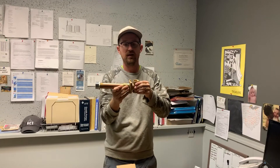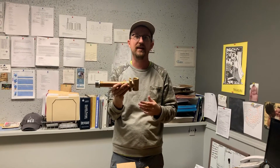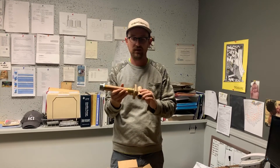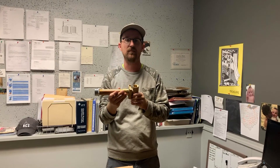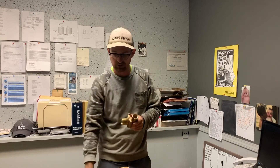This is an extremely useful component we install with every one of our concrete cisterns. It's essential for ensuring you can remove your pump with ease, without having to pump down the tank or crawl inside and risk safety hazards. This is our one inch pitless adapter — it's a lead-free brass fitting and a great component to add to your cistern system. Thank you for watching, and this product along with all our other products related to rain cisterns are on our website at rainbrothers.com.